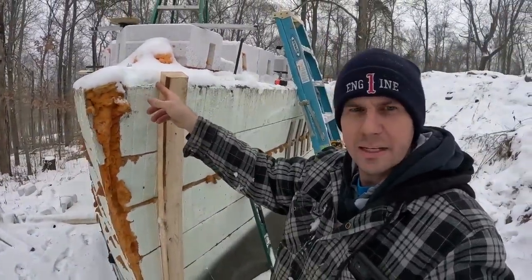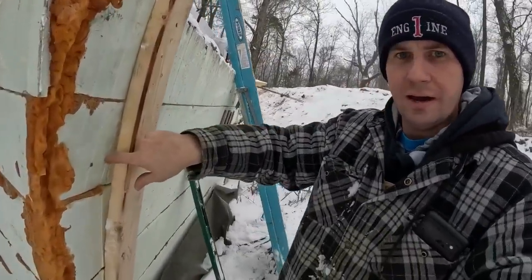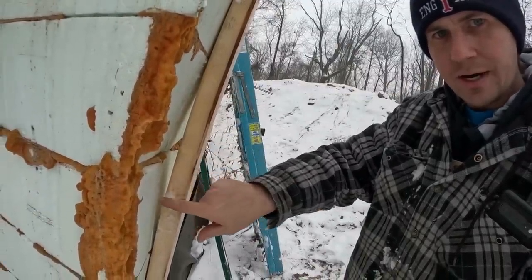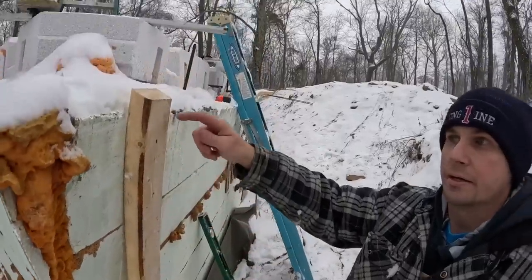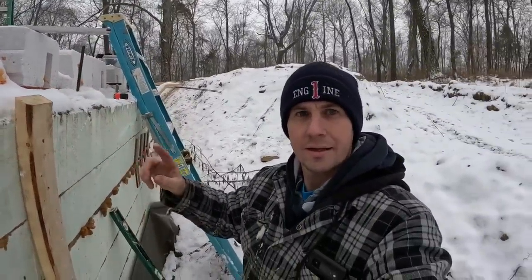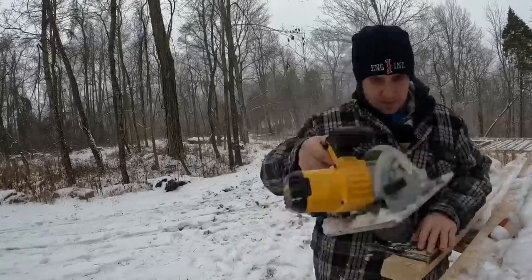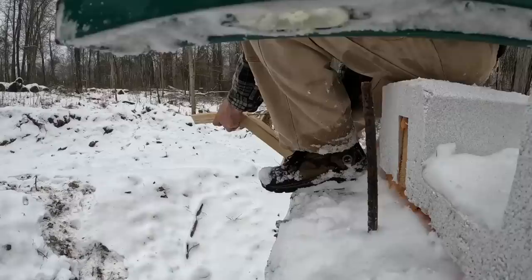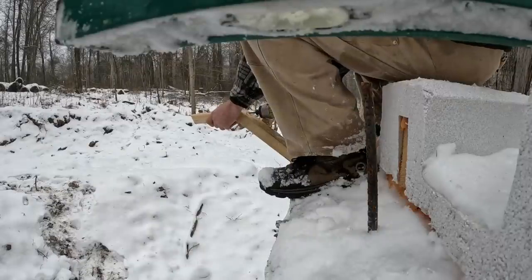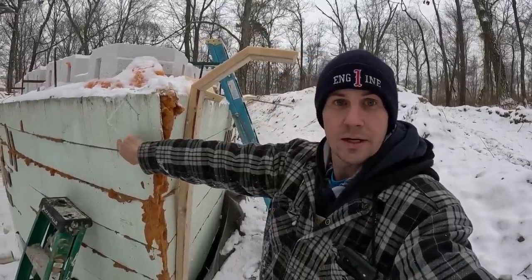So you can see, like I said, sticks up about 1.5 inches past that foam. Foam dies down because of the roll we have into it. We do have some gappage going right here, but we had that whenever we did the ICF, so I know what I need to do there and make that happen. Let's get this piece on, and then we'll slap a 2x6 on there. I've already got this stuff cut over here. Oh gosh, okay. So we can go ahead and get this side done.